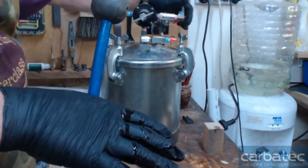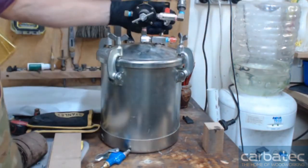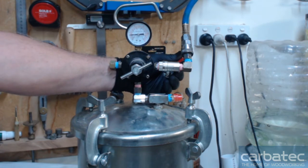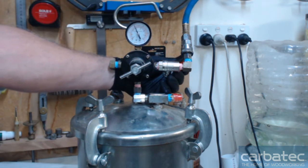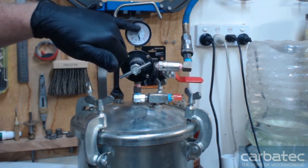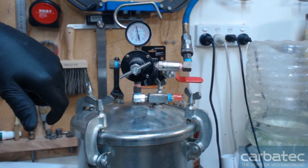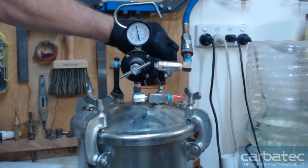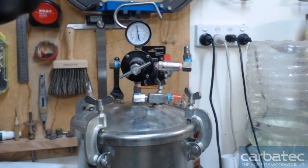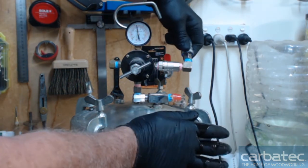Airline — I have the stopcock off. Put the airline on, then open up the stopcock slowly, because all that air is going to rush in and it can knock your job over if you let it go in too hard. I'll bring that up to between 40 and 50 psi. That's going to be close enough — that's 48. For the purpose of filming, that will do. So now I shut it off, remove the air, put my blower back on. And that blanked-off connector, I just put over there as protection.